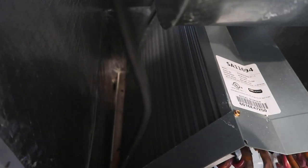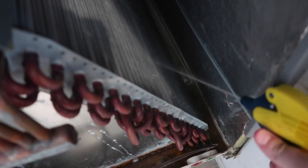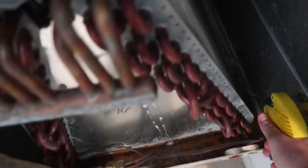A really nice thing about the evaporator cleaner from Refrigeration Technologies in the Venom Pack is that it's so safe to use. It's okay to leave some on the evaporator coil — it's safe to have in the airstream, it's safe to have around food. It's not going to hurt anybody, not the technician, not the customer. And it's going to work on those live organisms with the enzymes present in the cleaner. With the concentrate, it's really nice because it gets into the bottle a lot easier — you don't have to carry around jugs and jugs.